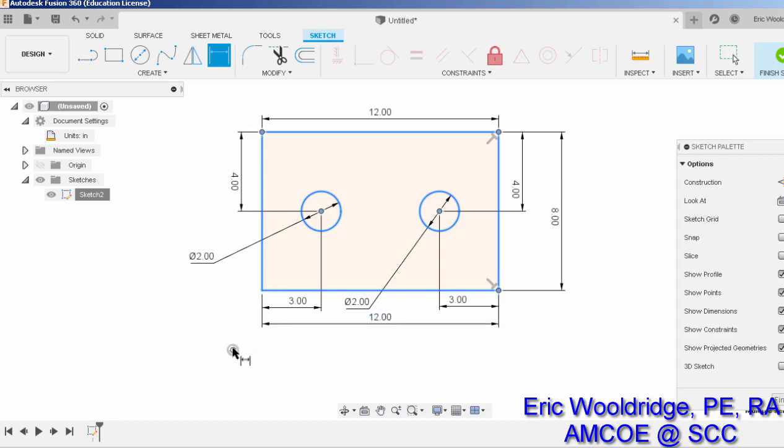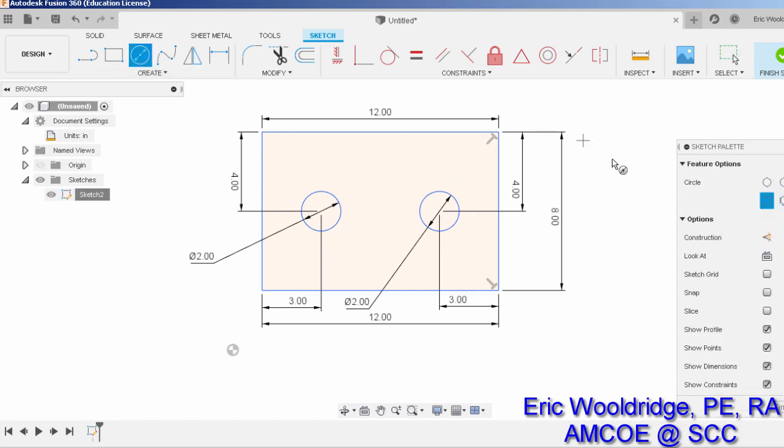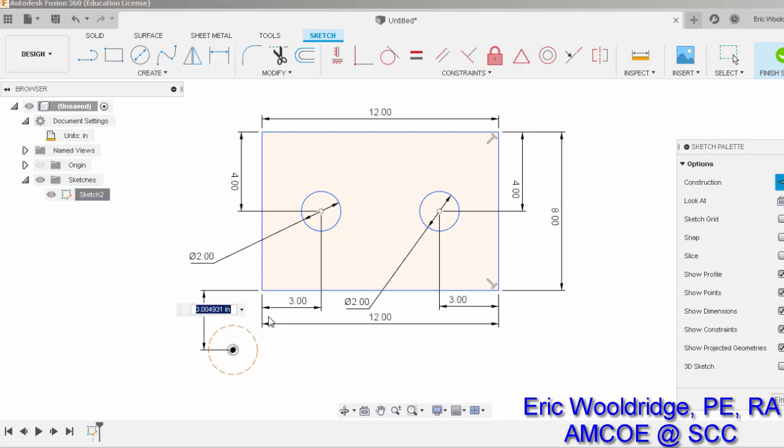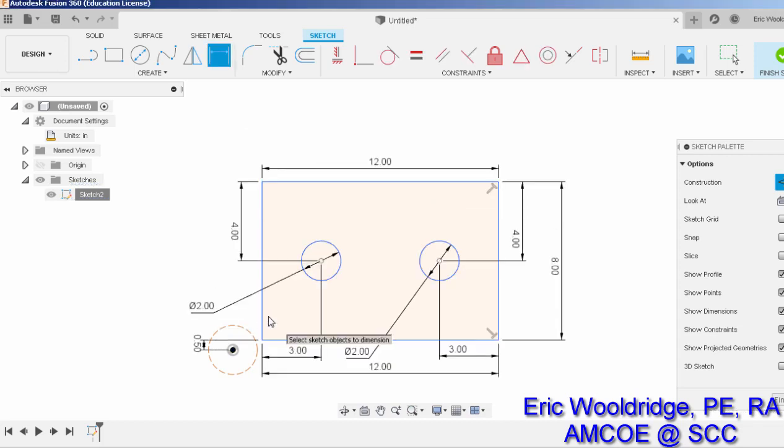and at least I think I am. No, it's not going to let me. So whenever you can't get it to actually let you draw a dimension, you can create your own by going to draw a circle and click on the construction line and click it to the origin and just draw it there. And then now you can go dimension here to here, set it, and let's just see if we go 0.5, pulls it down.